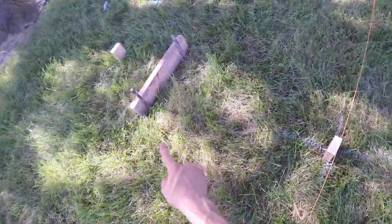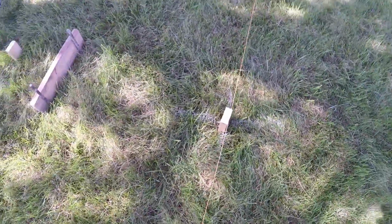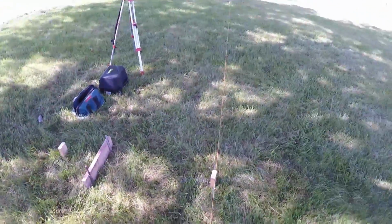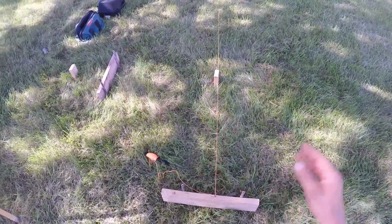So I'd repeat this for my other corners and obviously the back side, which we haven't set. And then if we remove this corner where the 2 strings intersect, memorializes our point. So that's method 1, using string lines to mark your batter board.